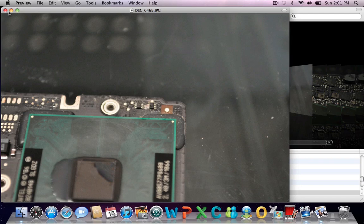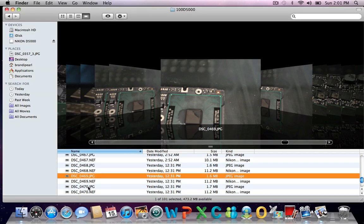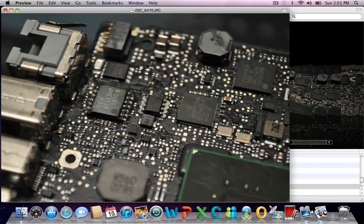It doesn't seem we have a more focused picture, but we did take a few. This right here is going to show the water damage coming across the board. You have corrosion on this pin and this pin over here. You can tell because the pads on this one show very clean solder, while this one right here shows circular formations, which is indicative of corrosion. This is on a Fairchild MOSFET, so that FET right there is supplying power across the board and has corrosion on it. You can see where it appears there's a water flow right here, because you have corrosion over here — there's a pattern that goes across here, and it appears to be water damage.